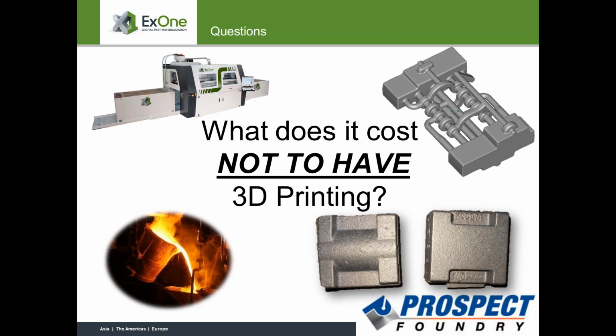And we have this one job that we've been discussing for a while, getting 3D cores printed, but we haven't gotten to the point of making the model yet. Once I can convince everyone to make the model, then, once we get the model produced, I think we'll be sending that down to them. Yeah, and keep in mind, when you make the model, it's not just the internal features of the casting. You have to create the core prints also. And those core prints that you put on your model need to match very close to the core prints on your pattern, so that you do, in fact, have that repeatability of how that core locks in the mold time